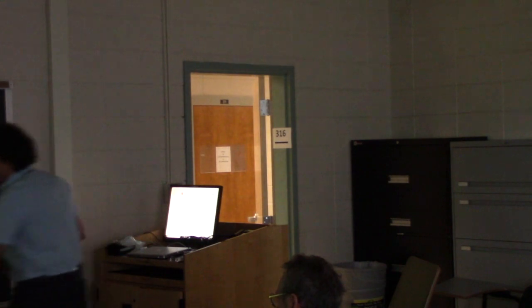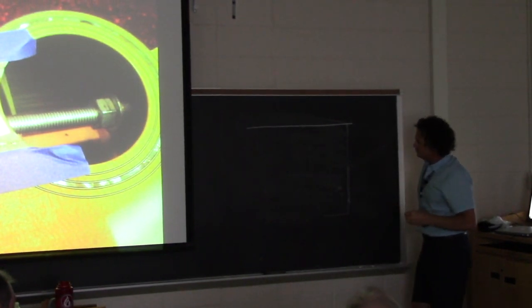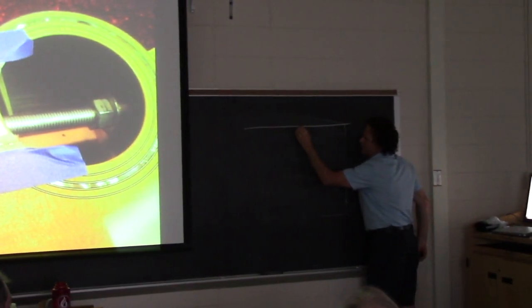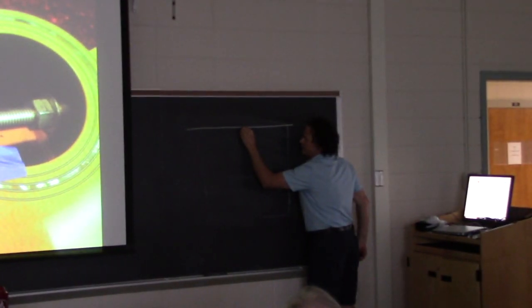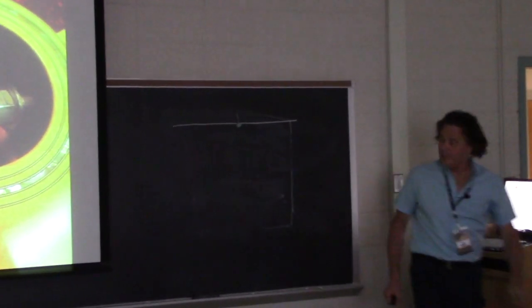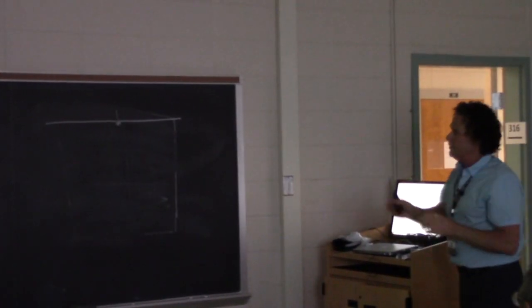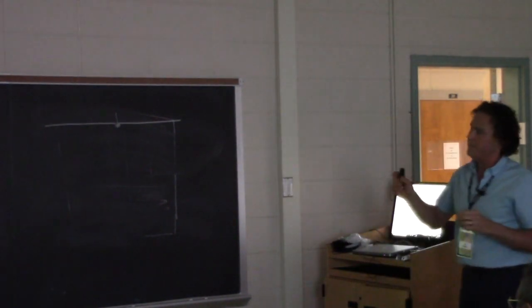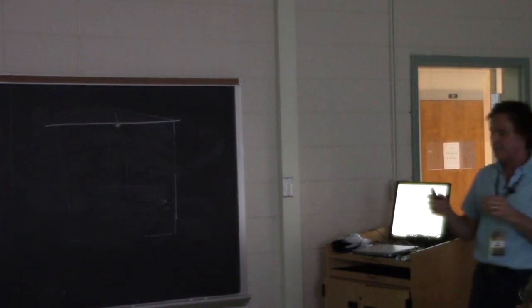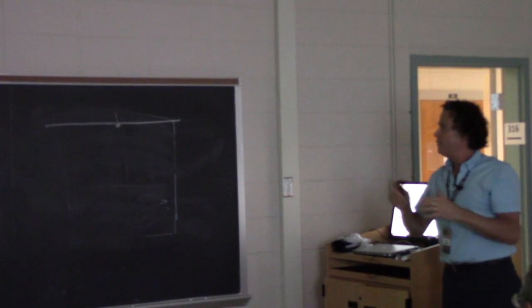And what kind of happens is, here's the soundboard, and there's the crack line. As that epoxy goes down, it's not to scale, but this just references where that crack line was. It comes down a little bit and spreads out just slightly. It's a pretty clean line, but to me that is almost like a cleat. It's like when you have horsehair plaster with lath, and that plaster goes in and goes underneath and it keys. It's the same thing.